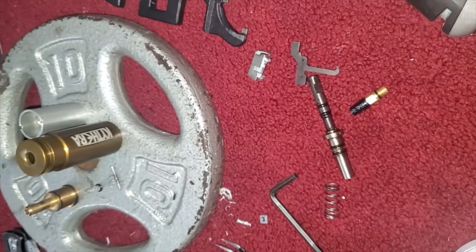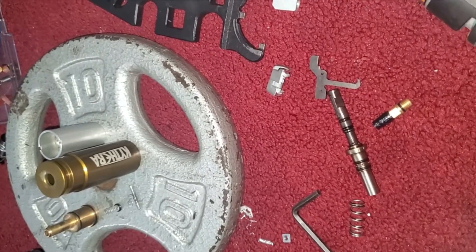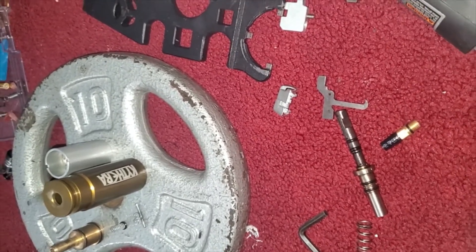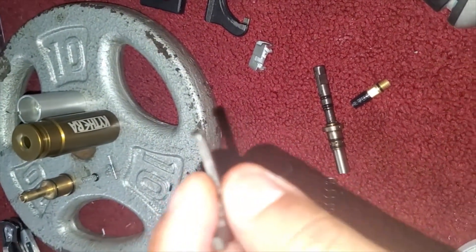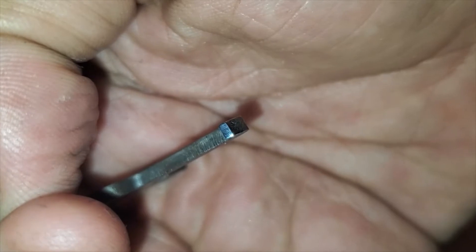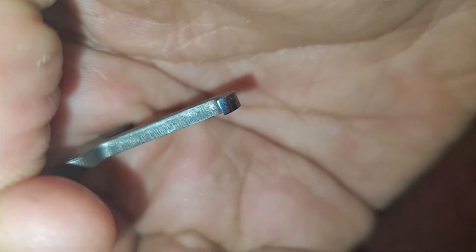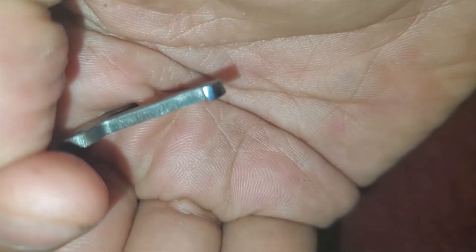I can't really tell you how it feels over video, but I had one that was mirror finished and polished, and one that was polished but wasn't sanded down to be smooth — and there was still a very noticeable difference in how smooth the trigger pull was. So if you're looking for that super smooth trigger pull that a lot of people buy Kytheras for, this is definitely one of the steps you're going to want to take. Here is the after — you can see it's much smoother, the light shines off of it much more evenly. This will give you that nice, super smooth trigger pull that a lot of people with finely tuned Kytheras are always raving about.